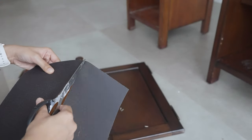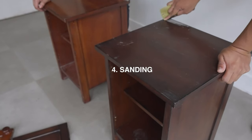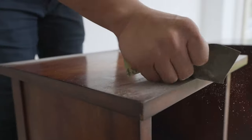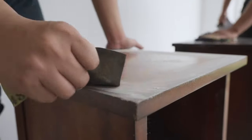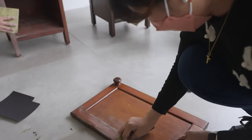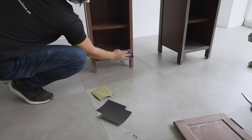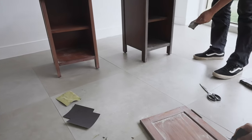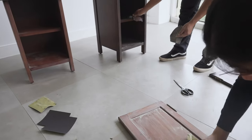Let's sand the surface lightly with 120 to 150 grit sandpaper. This helps even out and texturize the surface a little bit so the paint has something to latch onto. If your chosen furniture has a layer of varnish or paint on it, you need to sand it with a coarser grit sandpaper — try 40 to 80 grit instead. Then, wipe off the dust and other residue after sanding using a tack cloth. This helps to completely clear out the surface before painting to prevent chipping or peeling later on.